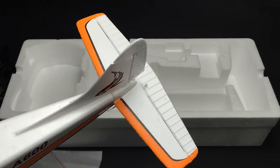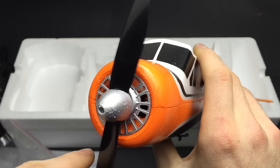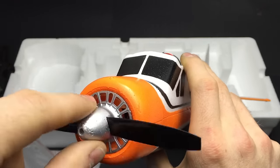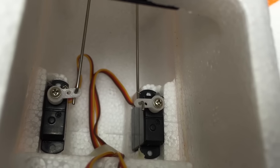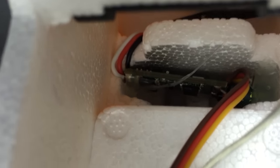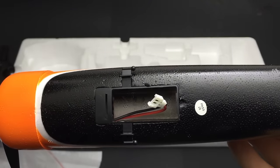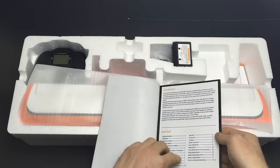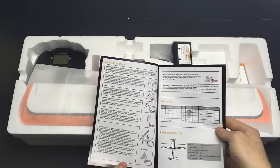The main airplane fuselage comes with all electronics pre-installed. The empennage has awesome detail and build quality. The direct drive 2500 kV brushless outrunner motor in the front has a very tight and snappy feel to it. The receiver is also a fancy flight controller with gyroscope sensors. There are two individual servos for the elevator and the rudder, and a separate ESC mounted next to the motor. Under the plane is a battery bay with a snap-on cover. It comes with a very nice little manual with lots of illustrations and good information — but seriously, how hard would it be to have a native English speaker proofread these things first?